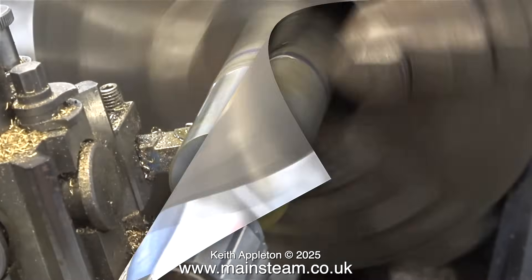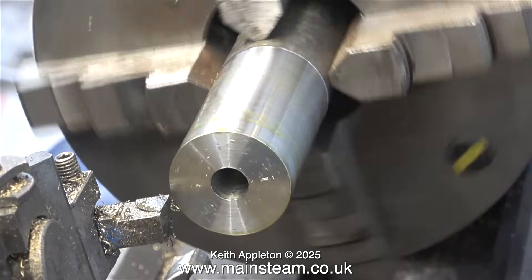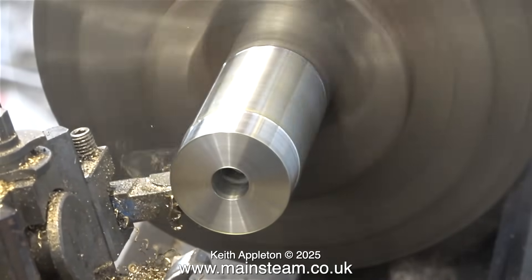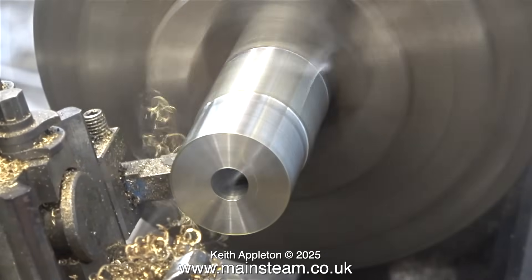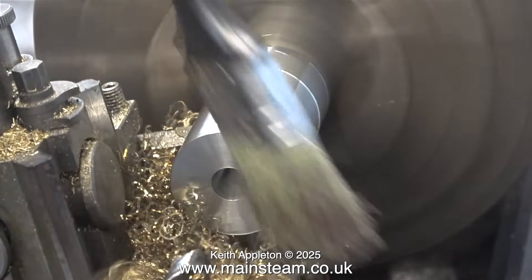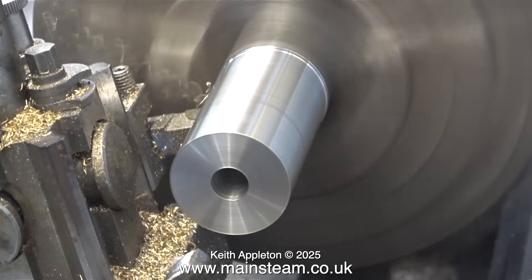The outside of this piece of stainless steel is a bit too big and it's damaged, so I'm removing some metal — not a lot, just a fine cut — and this wasn't enough so I went back and repeated the process. Very shortly I will end up with two pieces of metal that look very much like this, but not yet. I'm taking a very fine cut, going all the way down then turning it round in the chuck and coming at it from the other end. Quite a lot of swarf is mounting up — be careful with this swarf for two reasons: it's very sharp and also extremely hot. If you do cut yourself on any of this swarf, the only good thing I can say is the wound will be self-cauterising, but still very painful.